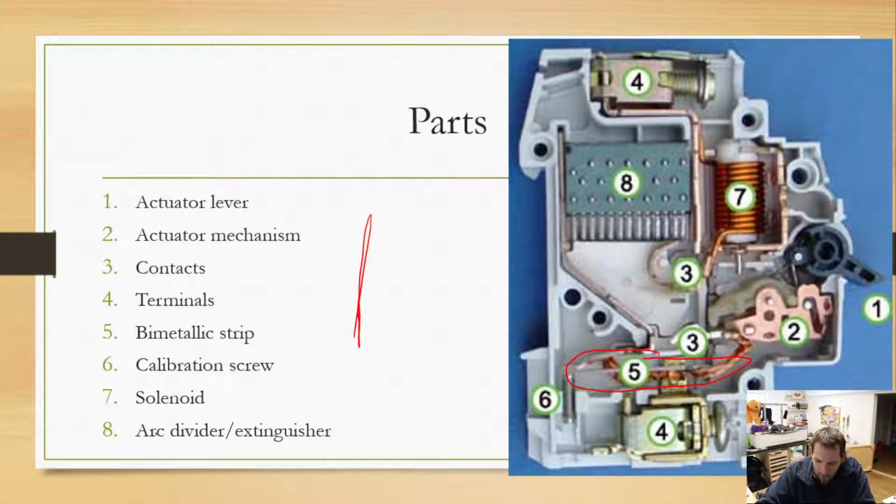So we have two different types of metal that they have welded together at the top. Hopefully you all know this, but if you don't, when metal gets hot, it actually stretches. Because these two metals are dissimilar, they stretch at different rates. So this one might stretch 1 centimeter per 1,000 degrees or whatever, and this one might only stretch a quarter of a centimeter per 1,000 degrees.